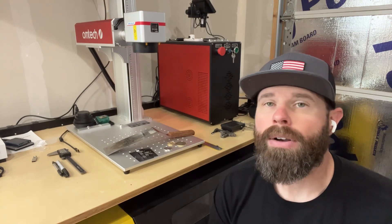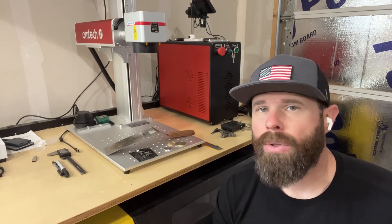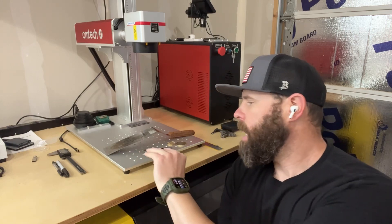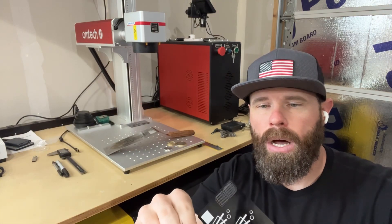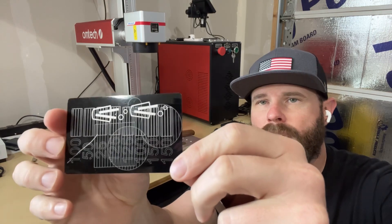So let's talk about some of the stuff that I've already done with this machine. Obviously when I first get my machines, I always go through and verify settings, do tests and all this kind of fun jazz. Here are some examples of different things that I did from testing. One of my first orders, I had this logo cup that I needed to do on a couple of keychains. So I did different tests to try and figure out my jump speeds, my start-stop speeds, all this kind of stuff on the laser. There are great videos out there that I'm not going to recreate because that's a lot of time that's already been done.